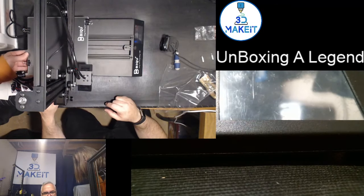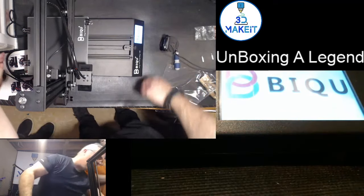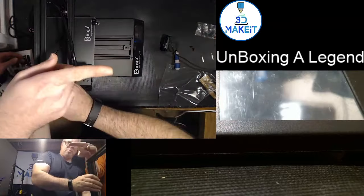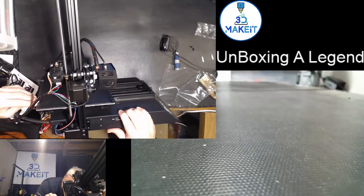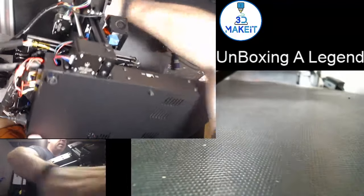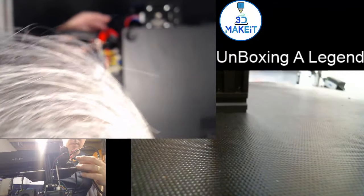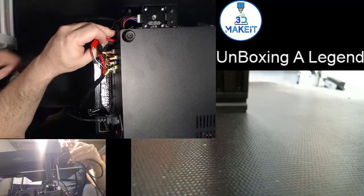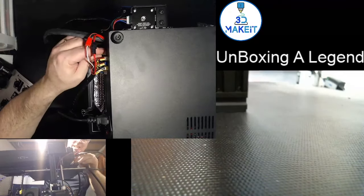Did it again. Okay, every time we touch this bed wire, it's shutting off. Oh, we might have a short. So we're just going to check the bed for a dead short. Let's flip it upside down, and then everyone can maybe see. Does this come back a bit? No. It doesn't look shorted. It doesn't look like they can even touch. But every time we were touching the bed wires, it shorted. So that could be something inside the bottom of the case.